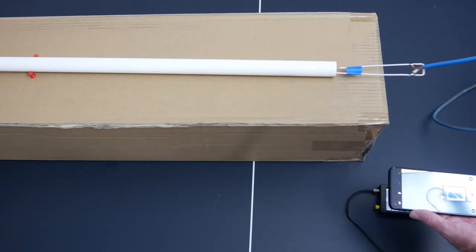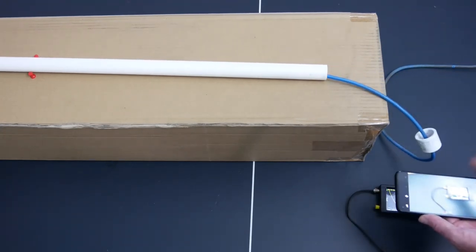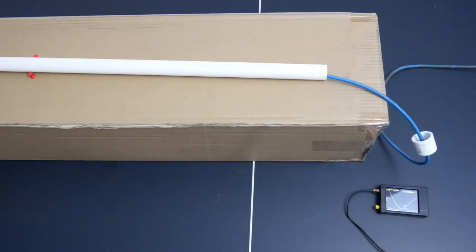The antenna became too short when I pulled it out of its PVC. Therefore, when I was designing this antenna, because it was going inside of PVC, I had to make it a little bit shorter than it normally would have been in free air without PVC around it. So that's velocity factor.